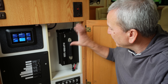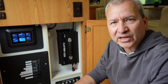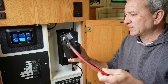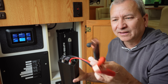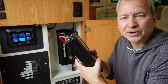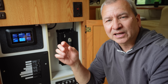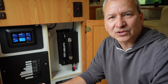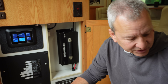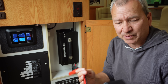Let's take a look at the charger. The goal is to find something that you can hardwire. You can buy a lot of chargers that are lithium compatible — some of them, like this one here, are a maximum 50 amps, but they may come with battery alligator clips and have various features and maximum output current. What we're looking for is something that can be hardwired and comes with ring terminals designed to hook onto your battery or some sort of bus bar. The alternative is if you use something like this, you'd have to cut the cables and make new connections.